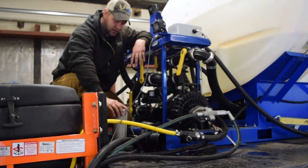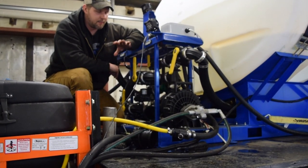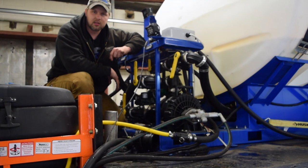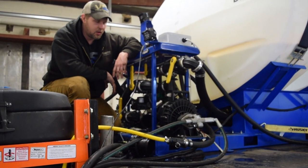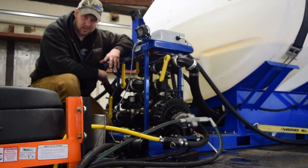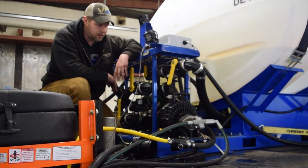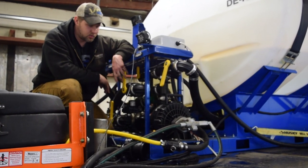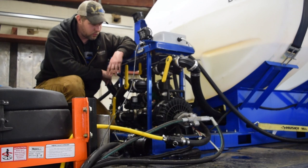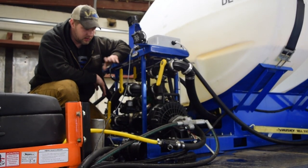Now, one of the final steps that I recommend, if you do have a gasoline engine, make sure that you clean everything up really well, and then we're going to want to focus on putting some penetrating oil or fluid film, WD-40, something on the engine, just so any residual salt that might be there isn't going to cause any rusting issues with the humidity and the oxygen during the summer. One part in particular that we like to focus on is the recoil cover where the flywheel and the block meet. Most of the engine failures that we see are due to that part seizing up. For some reason, that main bearing there, or the crank bearing, must be very susceptible to getting salt in it when it sits, and then it'll lock the entire engine up. It doesn't hurt to put a little oil in the cylinder, maybe if you like to fog your engines with some fogging oil, that works really well too. But really at the end of the day, your equipment will take care of you the way you take care of it.